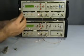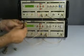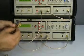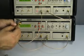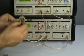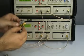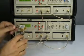We will connect the receiver to the coupled input port. We need to be very careful while screwing and unscrewing these SMA connectors as these are fragile connectors. We should not use excessive force and should always align them in the coaxial direction. Do not forcibly engage the thread as that will permanently damage the connector and measurements will no longer be repeatable.